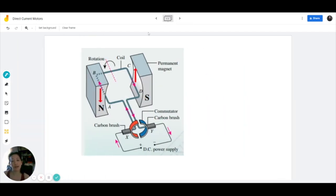And that's how this very simple direct current motor was invented. In order to enable continuous rotation, we have a commutator ring and a pair of carbon brushes. The commutator is quite simply a single ring that has been split into two halves. The colors here are not important — the reason why this diagram has it colored red and blue is so that we can take a look at what it looks like when there's a first half and second half rotation, as you will see in the next slide.